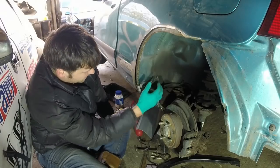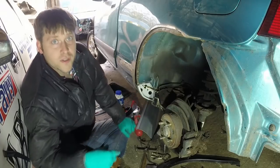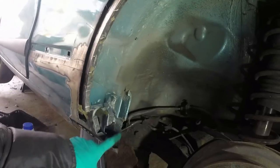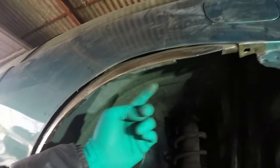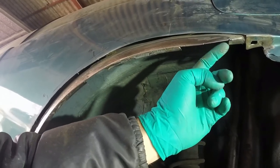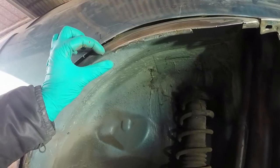So I'm going to mark that now because I'm happy with most of it, and then this top corner I'll have to bend around before I actually weld it on properly. I've just trimmed off a little bit more of the arch lip to get in and clean up the flange behind. I also cleaned up in here a bit more. There's a couple of bits where the return had rotted out or was just a bit frilly, so I've chopped those sections out. Next I'm going to make some repair patches just to go in here so that when I plug MIG weld my wheel arch lip back on, there's actually something there.